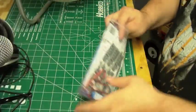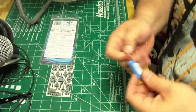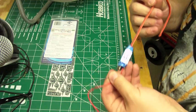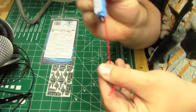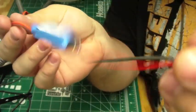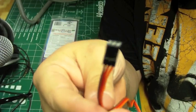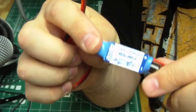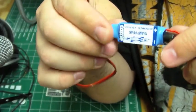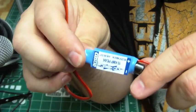For people who don't know what a BEC is: BEC stands for Battery Eliminator Circuit. It's basically a voltage regulator — you hook it straight up to battery power and it regulates power going to your electronics, plugging into the battery port on your receiver. This is a throwback from when we used to have to plug battery packs in to power servos and receivers. Newer speed controls started incorporating the BEC, but they're often underpowered, especially for crawling applications.